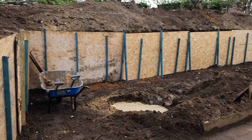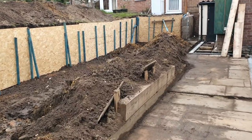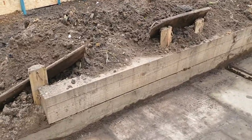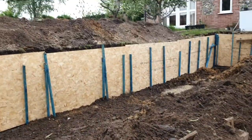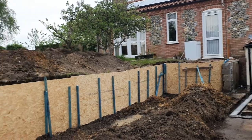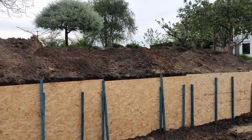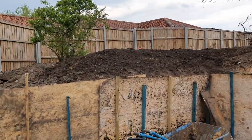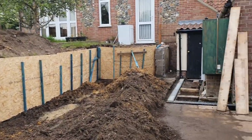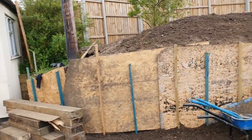We've took most of the middle soil out. They had two raised flower beds with the sleepers. But what someone had done is they put these sleepers down just on the soil, and there was a lot of moisture getting under. Because this is like a raised bed here — you can see the grass line, that was the original line. But on the top of the bank up here it's quite low, so we've lifted a lot of the soil up and pushed it up on top to level off the ground. Just to keep the soil back, we've put this partition up for the time being, to hopefully hold the soil while we get the footings down.